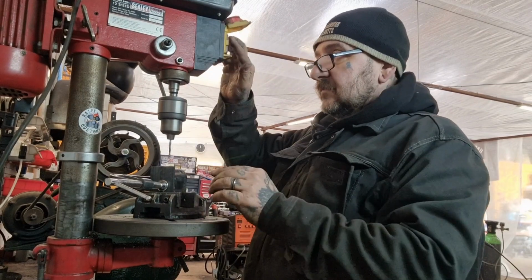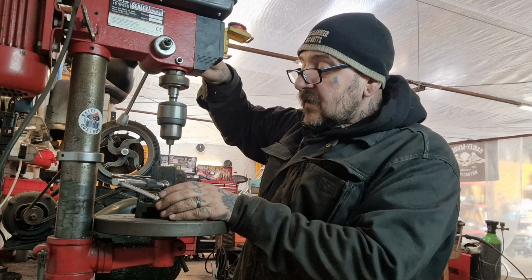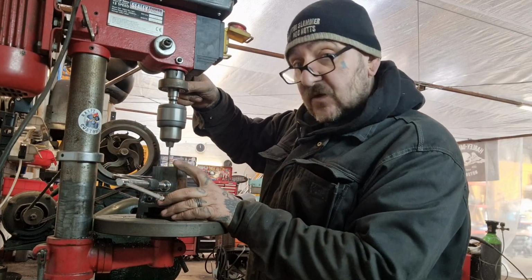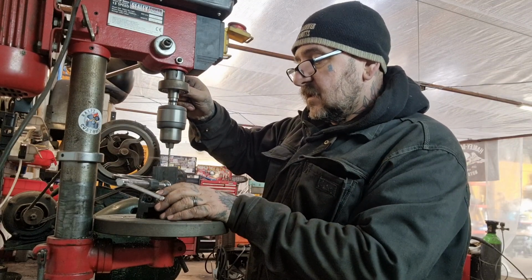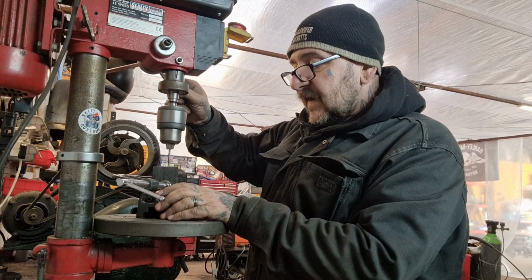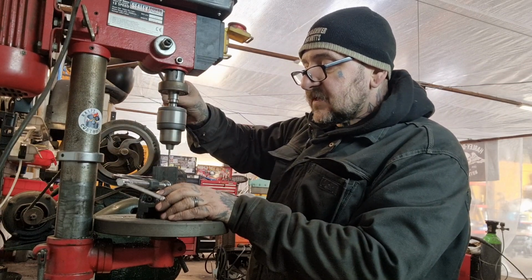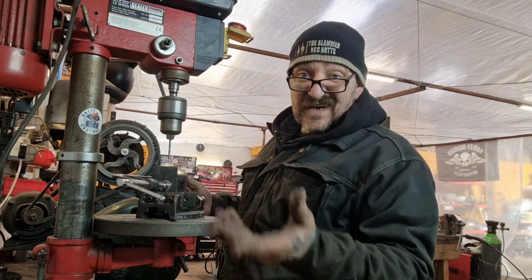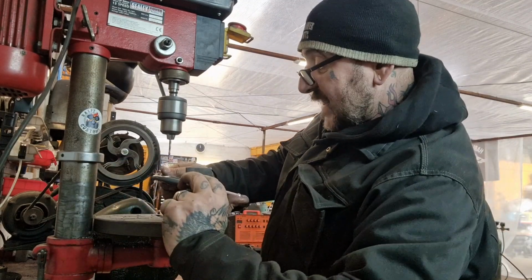So with it clamped in this vise, I can drill it out with the M5 grub screws that I'll put covers on. So we'll just go in nice, look. And I'm hoping we feel it bump through. There you go. That's just gone into the other bit, so we'll stop at that. And it'll leave a little dimple for us. We can go all the way through, it won't matter. The grub screw won't work its way into the unthreaded parts.